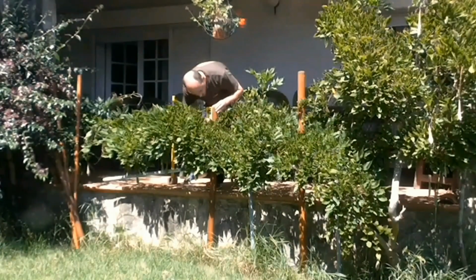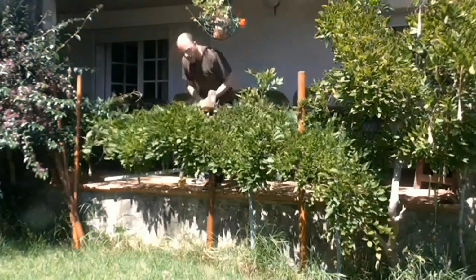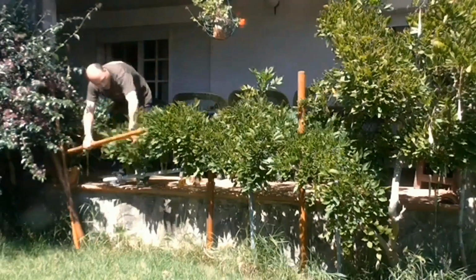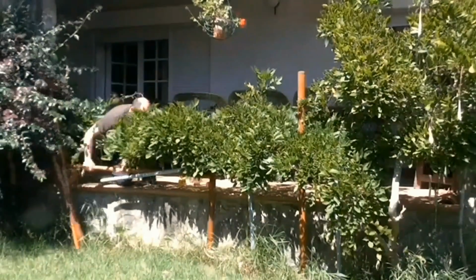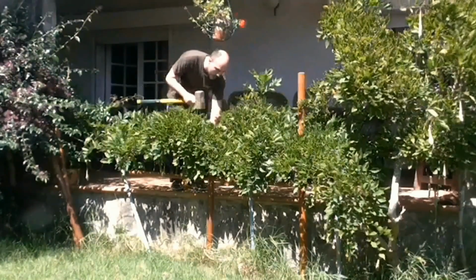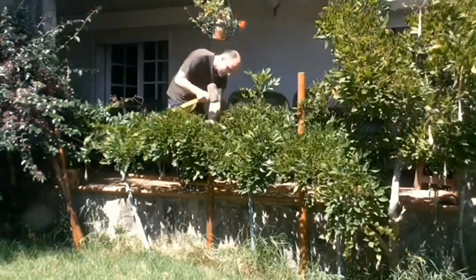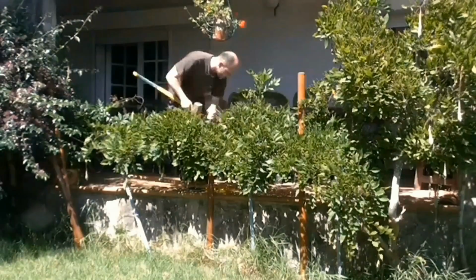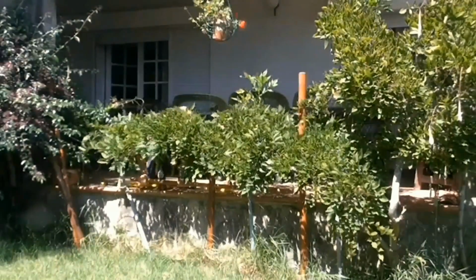And because the hole is too near the head of the post, I broke the end of the post with a hammer. So I put one horizontal post in the hole that is near the ground. Now, because the head of the post is broken, I can put a wooden block inside the top hole. So I can hit the wooden block to drive the post until the horizontal post is leveled with the right hole in the first vertical post.